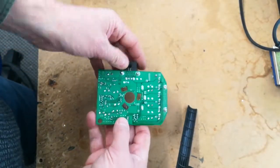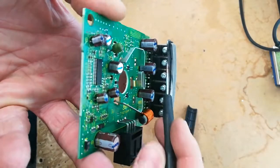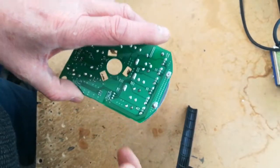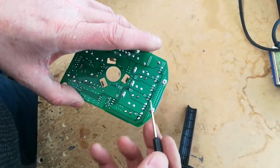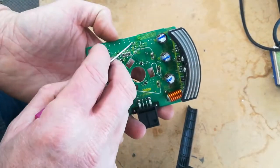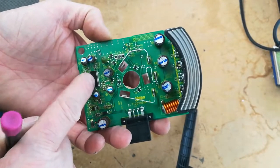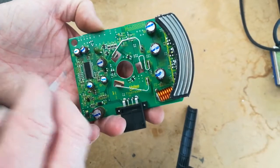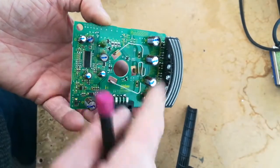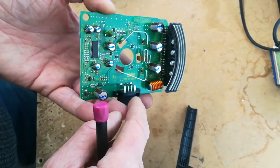Going back to the board — turning it over, you can see the drive transistors. On the picture posted earlier, one of these is blown, but it's just a screw attaching it to the heatsink. These are TO220 devices — we've posted a link about where you can get these, or they could be replaced with higher-spec ones. It looks like there are resistors in the gate drives here, which may protect the drive circuit. If the motor resistance looks correct, you can just replace the power transistor and you'll probably be good to go.